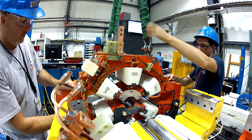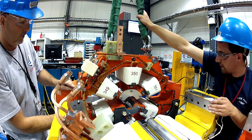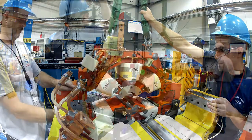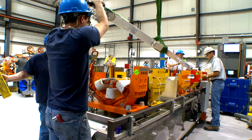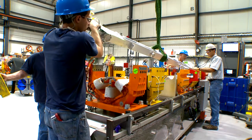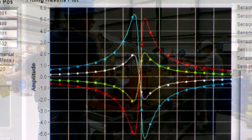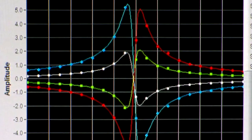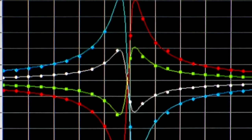Then the upper half of each magnet is removed and the vacuum chamber is installed and positioned. The magnet tops are reassembled and we move the girder into a temperature-controlled room for final alignment. The magnetic centers of the magnets must be aligned to within 15 microns of each other — that's less than the width of a human hair.